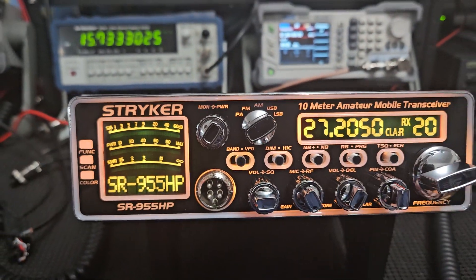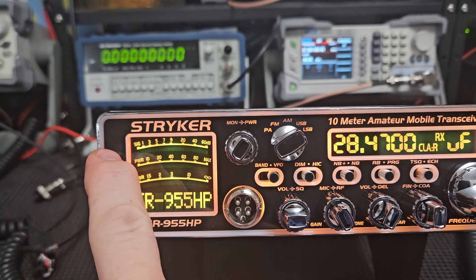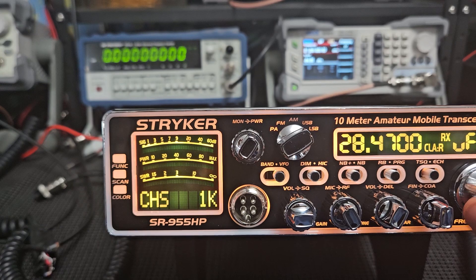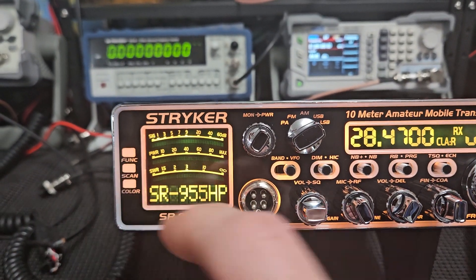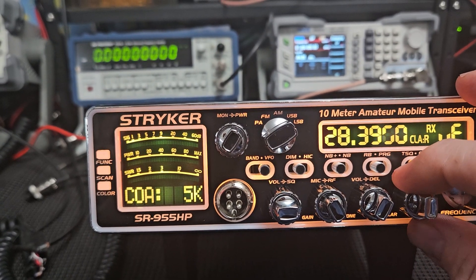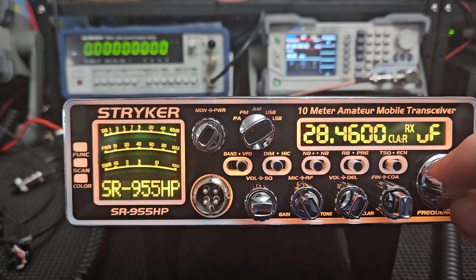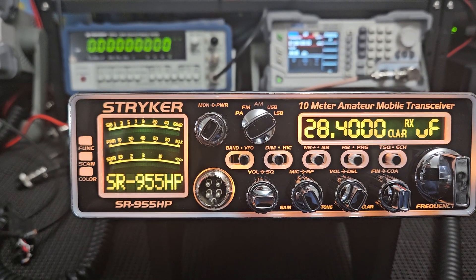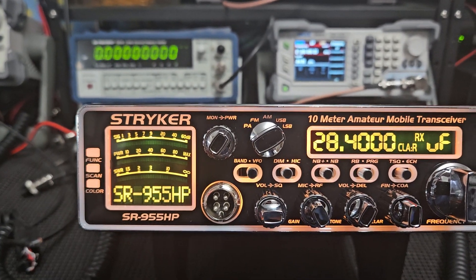The receiver is going to work outstanding too. In VFO you have a full-fledged VFO — if you don't like the one megahertz setting you can switch it. You can go 10k to get through the band a little faster, or 5k, or even 1k to maneuver more precisely. This is like a full-fledged VFO — you can use this as an amateur radio, that's what it's intended for. You can switch down to 12 meter, take it up to the FM portion — it has the repeater shift option and CTCSS/DCS, the whole nine yards, so you can use it on 10-meter repeaters.